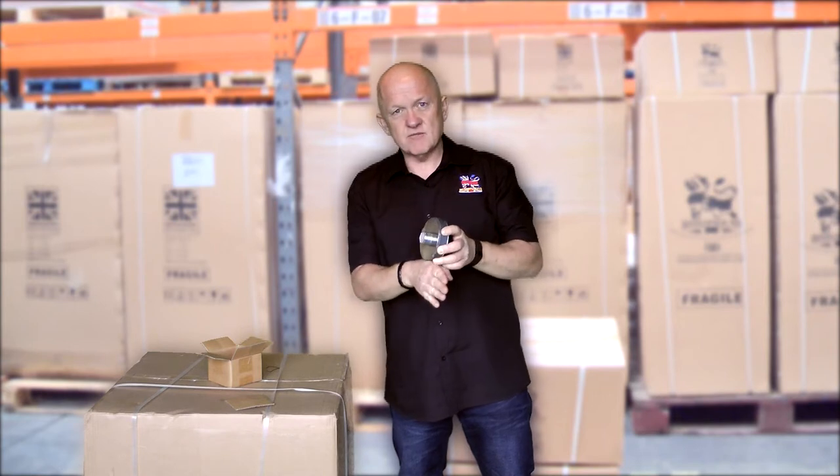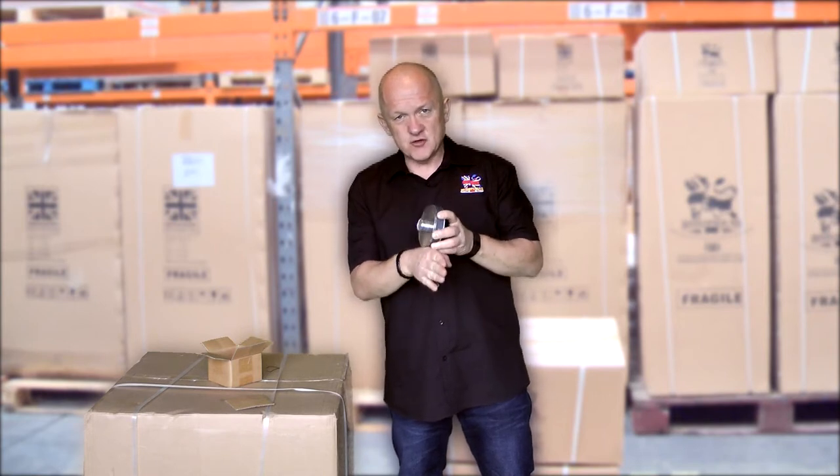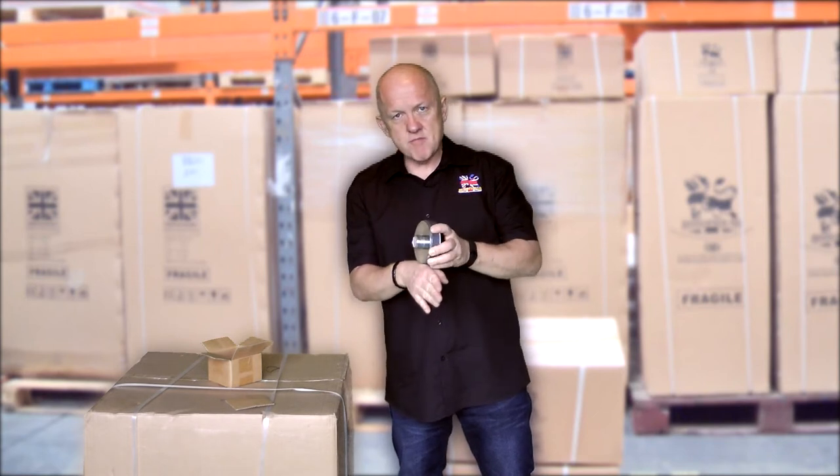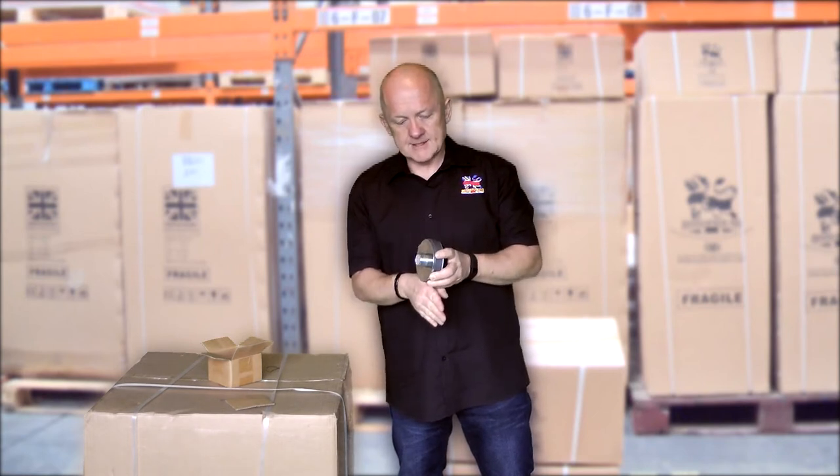And that's the compression driver. It's quite heavy, so if you're building your own speakers, make sure you brace it with some wood underneath, because if you drop the speaker a little bit heavily, or put it into the van at the end of the night too heavily, it could shear off. So if you're making your own speakers, make sure you brace the compression driver into place.